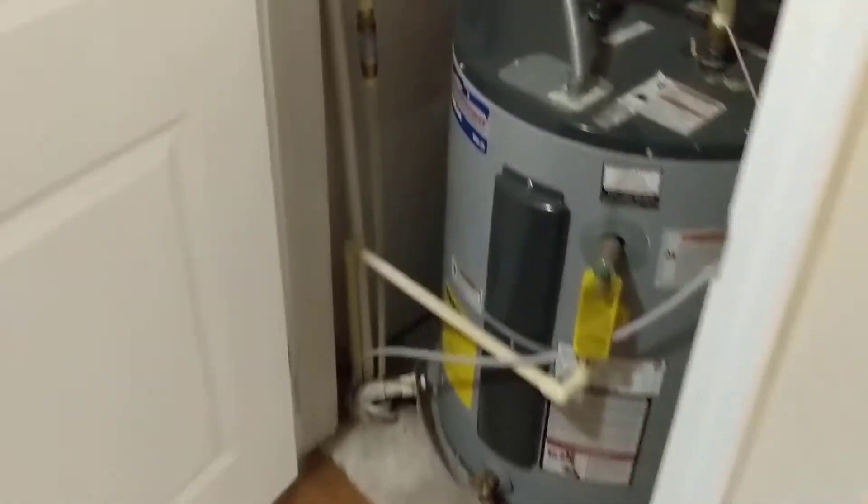Let's go out there and pull the covers off the water heater where the elements and thermostats are, and we'll ohm out the elements. We'll also check the thermostats, and if everything looks good there, we'll check the wiring going into the unit.